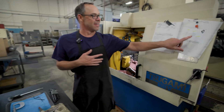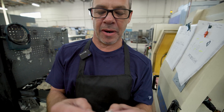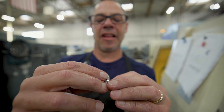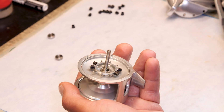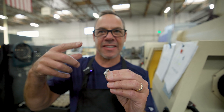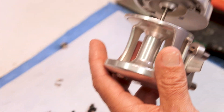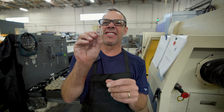This is a good one — it's a cast control for the turn reel. This is in the raw state; you can tell there's a little bit of burrs. We'll clean those up when it goes into polish. You see these little holes around the outside? We assemble little pins in there and then little weights go on the pins. So when you cast the reel and the spool goes a little bit too fast — it's overrunning — those little weights come out. The centrifugal force forces the weights out and then it slows the spool down. It's a critical mechanism for the cast control — part of the secret.